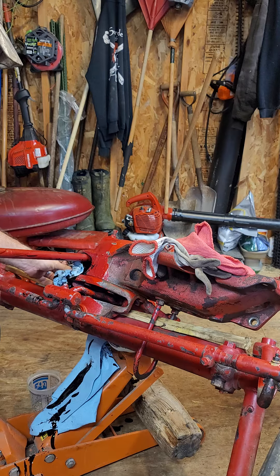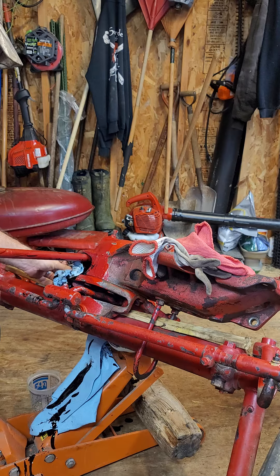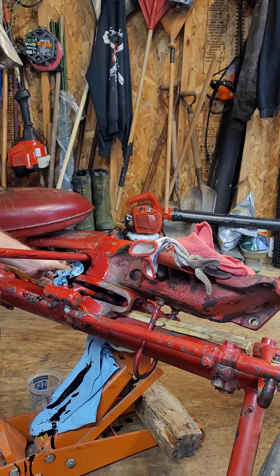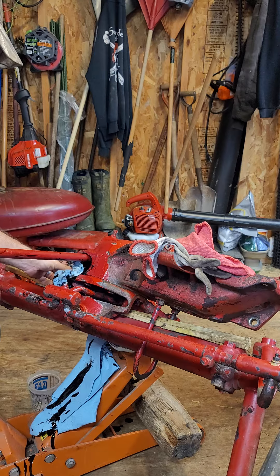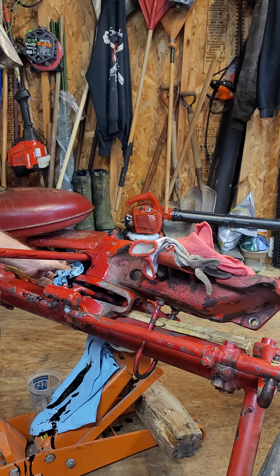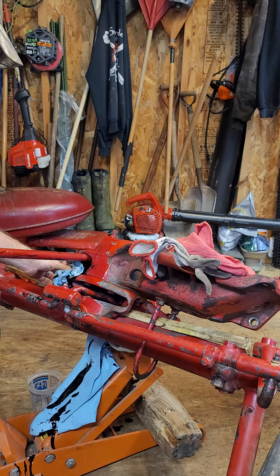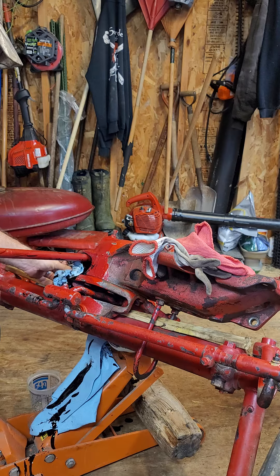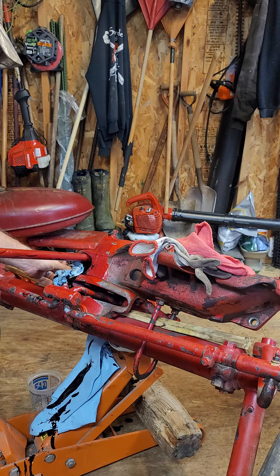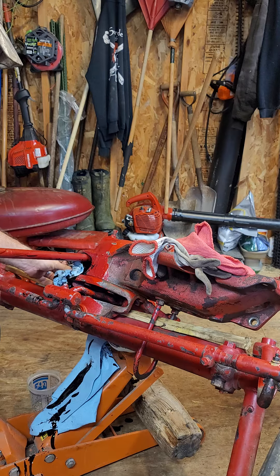I'm going to loosen up this U-bolt and drop this out so I can release the front end. A lot of people said how these are extremely awkward and require two people to take them off. The way I did it actually was not that bad. As long as you get the tractor supported — putting the jack under the front and putting wood under the bolster — though I got lucky and it didn't affect me. I'm not putting a lot of pressure on that U-bolt; it's not even mushroomed, it just threads off. And then that's off — pretty simple.